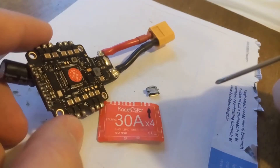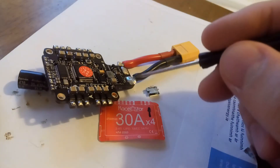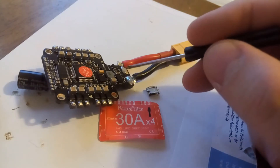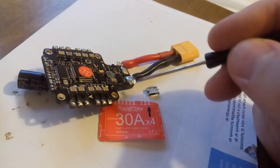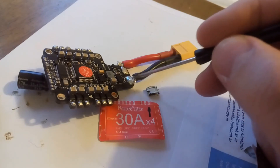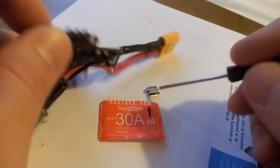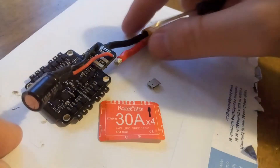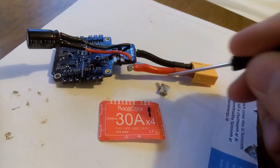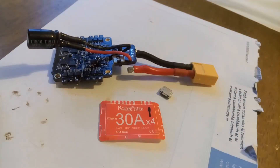Just something to watch out for when pre-tinning and working on this board in particular: give it enough time to cool after each pad. Pre-tin the battery plus, let it cool completely, then solder the wire - one step at a time. Also stay away from touching the USB connector. I would call it a bad design to put the USB connector right next to an area that takes a huge amount of heat from soldering the wires. Thanks for watching, and happy flying!